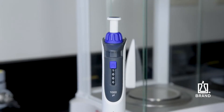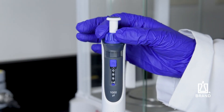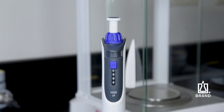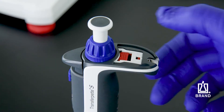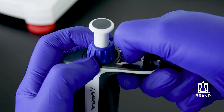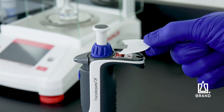The system is now decoupled. Next, unlock the volume change protection and turn the volume setting wheel to the volume determined gravimetrically, then lock the volume change protection. Now pull the adjustment slider completely back again, drop the volume setting wheel to its original position, and release the adjustment slider. The system is now coupled. Replace the labeling tag.